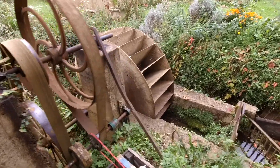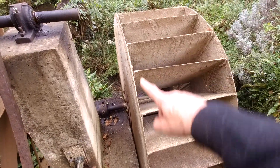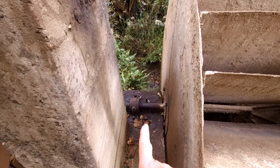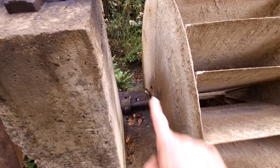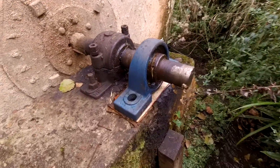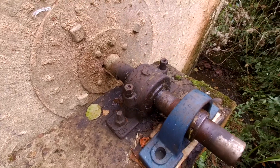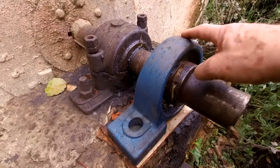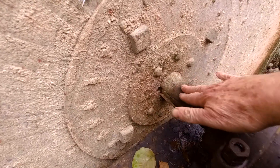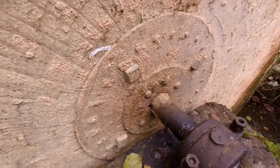The waterwheel is about 150 years old and it's probably about two meters in diameter and runs on this shaft here. Unfortunately the wheel became disconnected from the shaft. This is what I think broke it — it needed a new bearing. This old bearing's ball races have completely smashed. So I put this new pillow bearing on and shimmed it, and I think what happened is it lifted up the shaft where it connects with the wheel, putting a lot of stress on this ancient wheel and it broke.